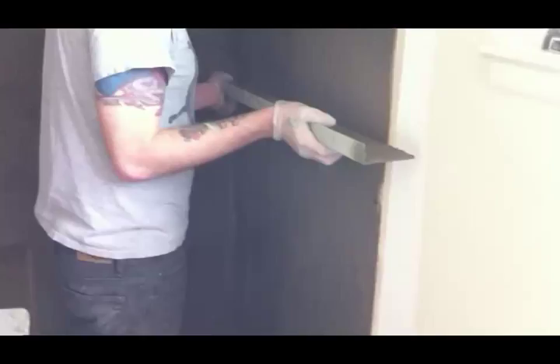Then you take a metal edge and just start rodding off the mud with a seesaw motion going back and forth. Just kind of check if you've got enough mud on there, and once you do, you go for it — just seesaw. With that lime it keeps the mud on the wall. You need that lime in the fat mud. You don't want the fat mud too loose — you want it just right, like stucco consistency.